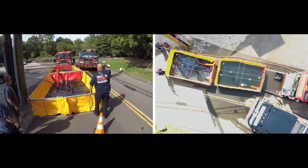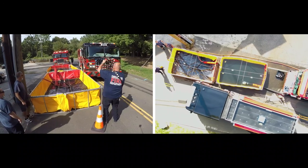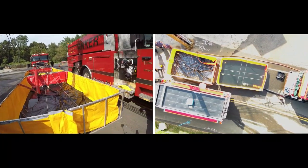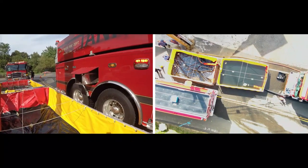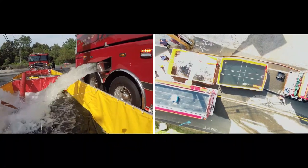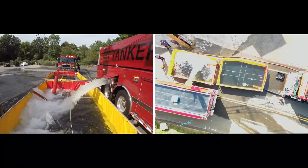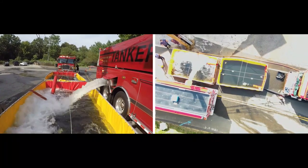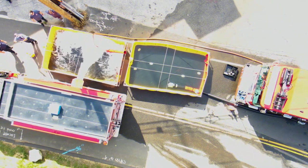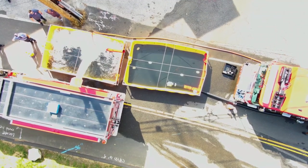We are now ready to have additional tankers enter the dump site. The first portable tank is always the priority to fill or top off. The tanker can then move on to the next tank with its remaining water. At no time should fire personnel be between tanks or tankers. Once the portable tank has water in it, the pump operator can begin a transfer process if needed. The operation of a Holi tube is just like a hand line — open the discharge and set the pressure. A 75 psi discharge pressure is a good start and will move approximately 1,000 gallons of water per minute to the next tank. Priority is to always keep that first tank full; if you need to move more water quickly, simply increase your pressure.